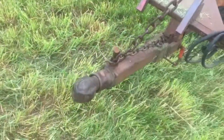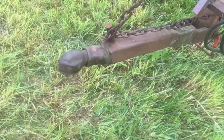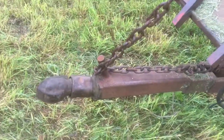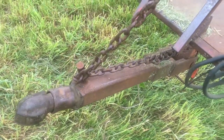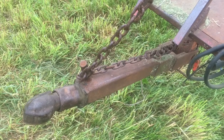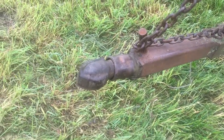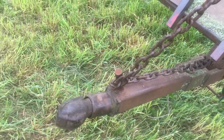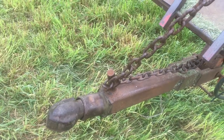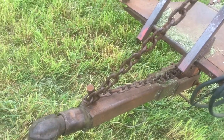Over that process I've done a lot of modifications and repairs. These Easy Trail Bale Baskets come with a telescoping standard agricultural tongue, and those finally wore out years ago. Because I pull these down the road behind pickups to deliver hay, I put on a regular ball hitch, which made these things tow down the road a lot easier — and they're easier to hook up than the telescoping tongue.